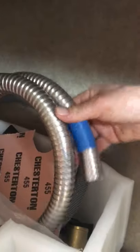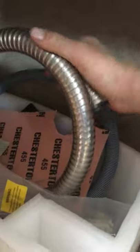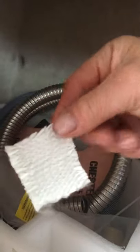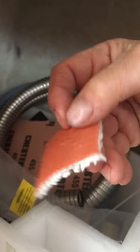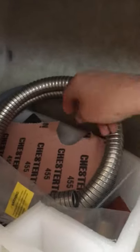The exhaust tubing I used is from Briley Hose. You can bend it in a reasonable sort of radius. That's the material used for the insulation, high temperature siliconized fiberglass tubing.